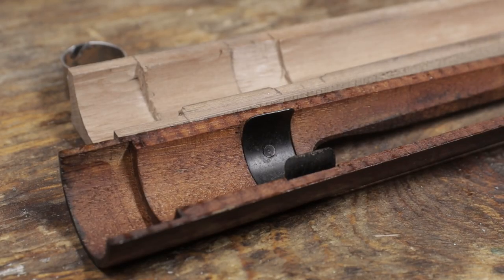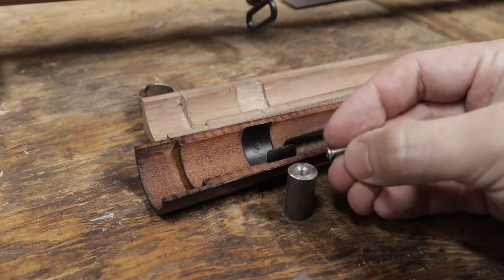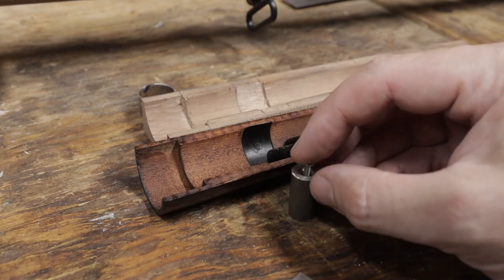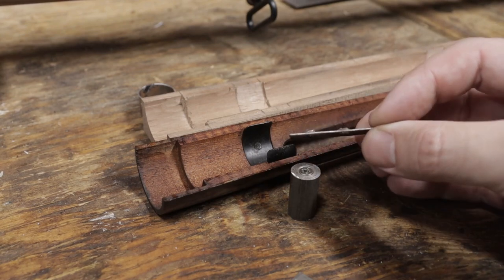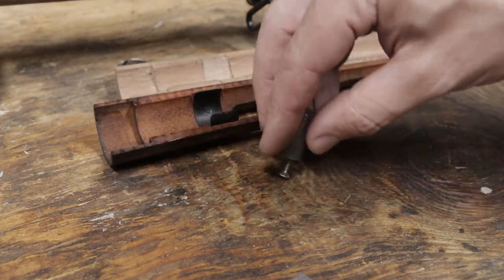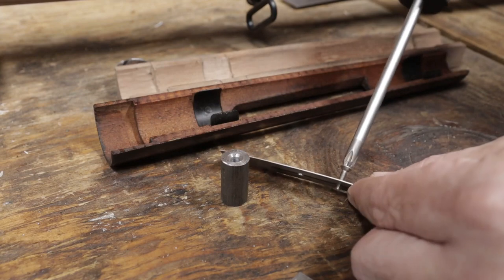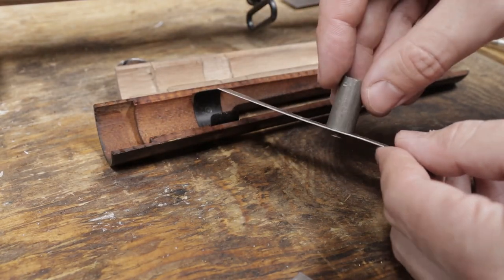With the holes drilled and deburred, I'm looking at how I'm going to attach the rivets. I made this tool that has a countersink in it that matches the head on the small screw. It fits in there, like that. I'll sandwich the clips between the two to create a countersink, like on this test piece. This will be for the head of the rivet, to have a better hold than if this was not here. The screw I'm using to form is a tight fit, because when it's countersunk, it'll enlarge the hole slightly. I'll get it in there, and then move to the press, and give it a squeeze.